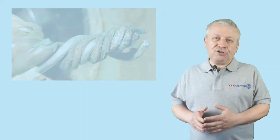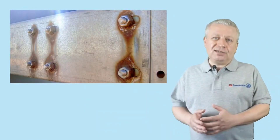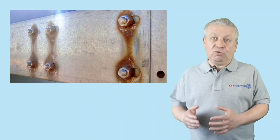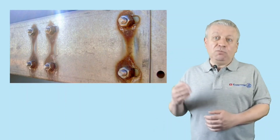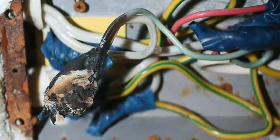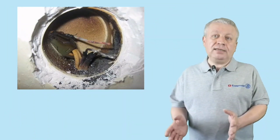Aluminum and copper are galvanically incompatible. If you connect them, you get something like a mini battery. When current passes through such a connection, even at minimum humidity, there is an electrolytic chemical reaction. Problems are bound to manifest sooner or later: oxidation, weakening of contact, heating with melting insulation — and as a result it will end in a short circuit, burnout, or fire.